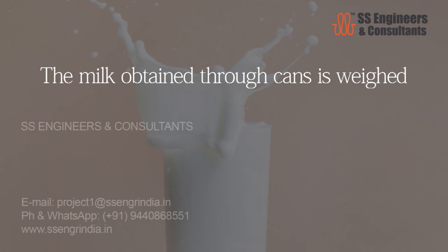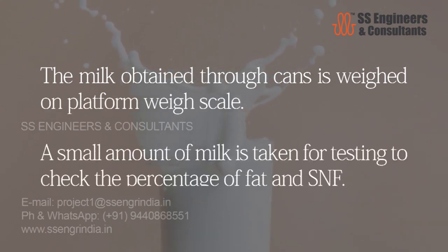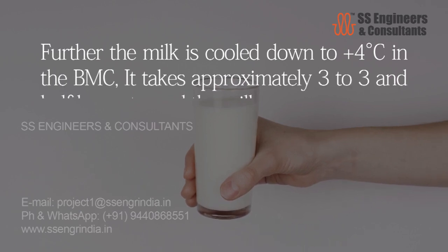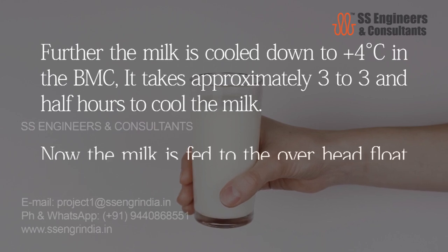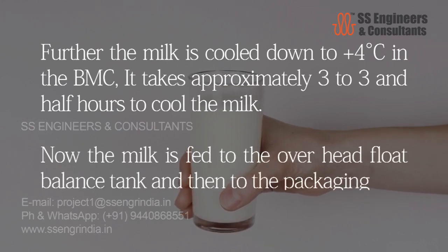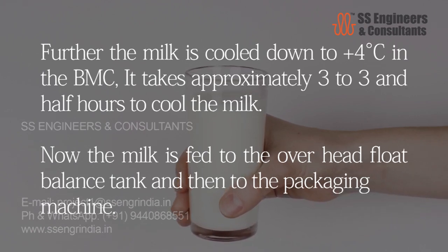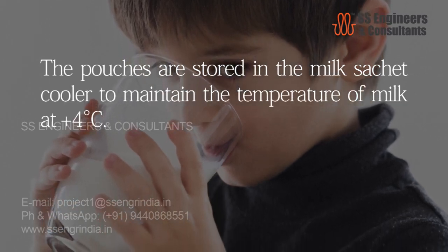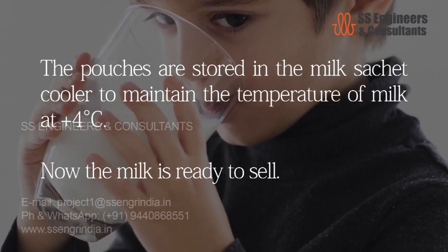The milk obtained through cans is weighed on a platform weigh scale. A small amount of milk is taken for testing to check the percentage of fat and SNF. Further, the milk is cooled down to +4 degrees Celsius in the BMC. It takes approximately 3 to 3.5 hours to cool the milk. Now the milk is fed to the overhead float balanced tank, and then to the packaging machine. The pouches are stored in the milk sachet cooler to maintain the temperature of milk at +4 degrees Celsius. Now the milk is ready to sell.